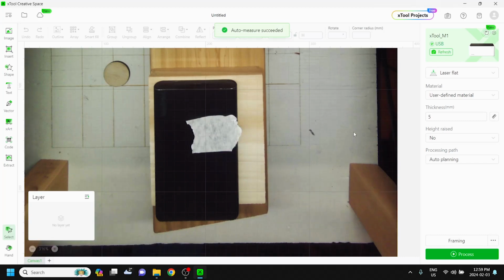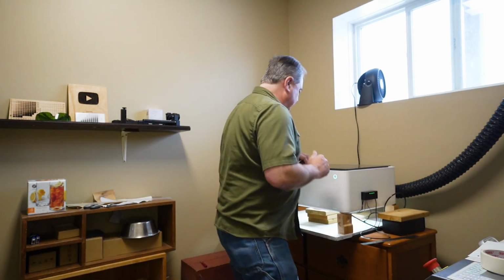and it worked. So just keeping in mind, I've run into that before with certain materials, and I've fought with it for what seemed like forever. And then I thought, you know, what about the reflection properties of these materials we're using? And sure enough, throw tape on it, because measuring it, like you brought it up, you brought it down, what's going on? So a little hack to make sure that you get the good measure on items that may reflect or change the pattern of that laser. So I'm going to take that tape off, and then we will get the pattern started.